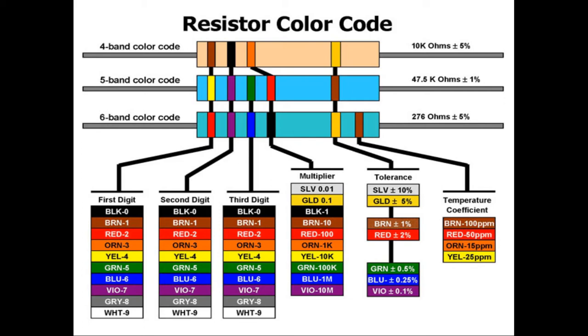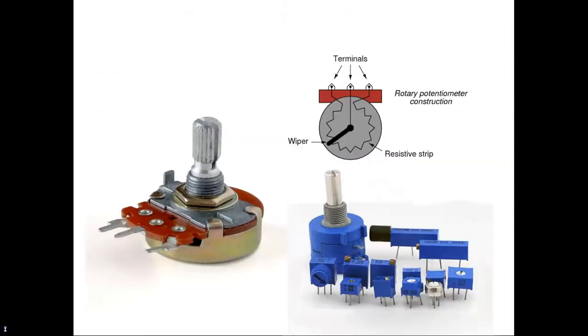Basically it's a type of scientific number or exponent value that has two color bands representing the first two digits of a resistance, followed by the number of zeros, or the multiplier. So we'll talk about that in greater detail when we get into the lesson on resistances. And also when we build each project, I'll review this quite a number of times.